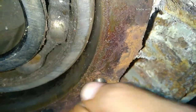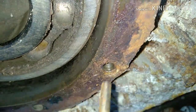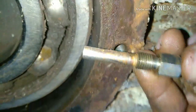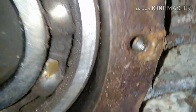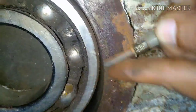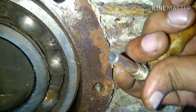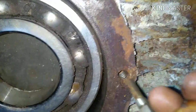Let's remove the BTD and see how it is placed. This is a bolt-type BTD — the probe is designed like a bolt. You can see this is the probe. This probe goes inside the bearing housing and is connected there. Whatever temperature is generated by the bearing is transferred to the end shield or bearing housing, and from there it is sensed by the BTD and transferred to your metering circuit.